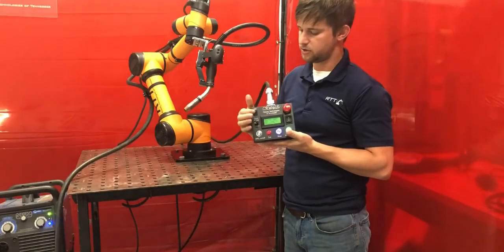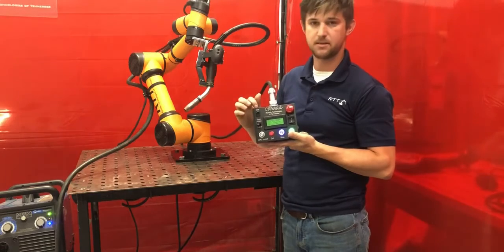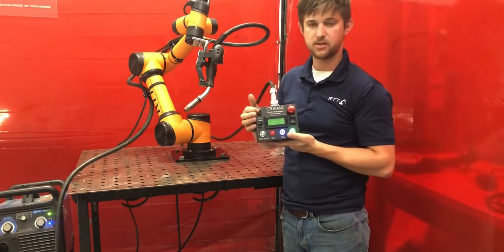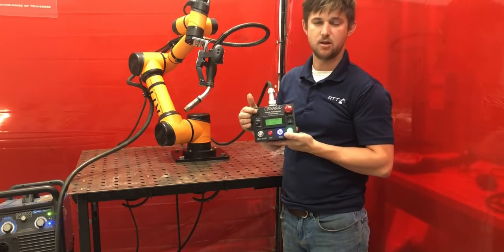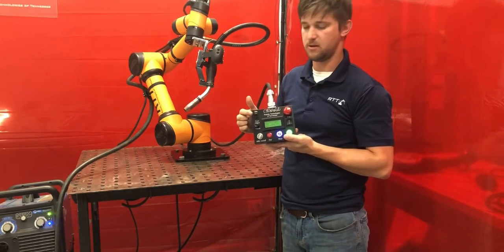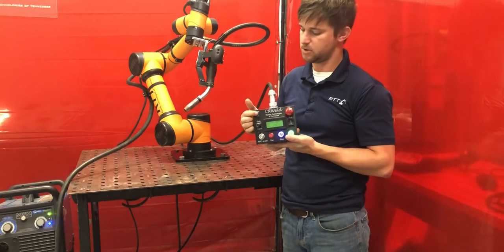This contactor trigger switch that has the word gas above it is essentially just like pulling the trigger on the torch itself. With that said, you have to be careful to make sure that you don't accidentally strike an arc anytime you push this button. Now that we've finished setting up our system, we can take a closer look at how to use it.